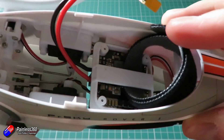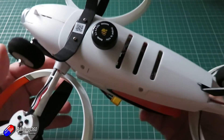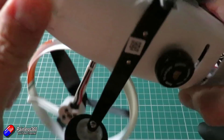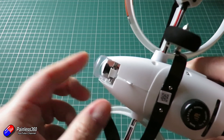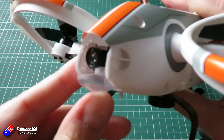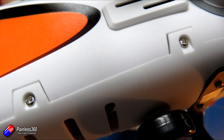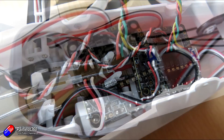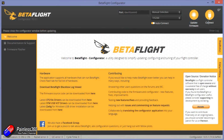To access Betaflight, you need to get into the flight controller — and again, you don't need to do this to fly it; you can just follow the instructions and it'll fly okay. I'm fascinated to see what they've done and how this all works. So I'm going to connect to it. First I have to remove the bottom cover and then pry away the flight controller, which connects to the power distribution board underneath via a number of riser pins. Be very careful prising that up, and then you can easily get into the USB connector and plug it into Betaflight.